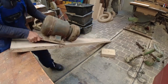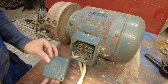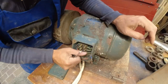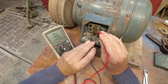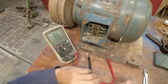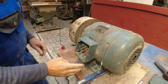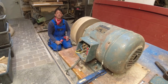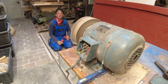Now I had to deal with the motor. As an induction motor, it was switched on with a star-delta circuit with three-phase power. I removed all connections and measured the winding resistances. For a 3-kilowatt motor the values seemed plausible, so I wired the motor in a star. It ran decently, but I wasn't entirely happy with the noise — maybe one of the bearings has a slight damage.